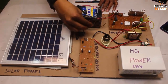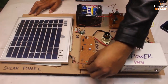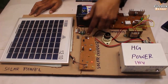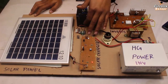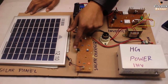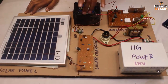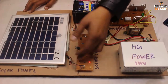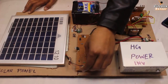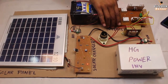This circuit is actually capable of providing nearly 14 volts, which is then converted into 12 volts using this circuit. You can also charge a 6 volt battery — in that case you use this potentiometer. This is a charge regulator using the LM317 IC, which provides the proper charge to the battery. This LED is the indicator, this diode provides unidirectional current, and this diode holds the current of the battery — whenever no power is coming, this diode won't allow current to flow in the reverse direction.